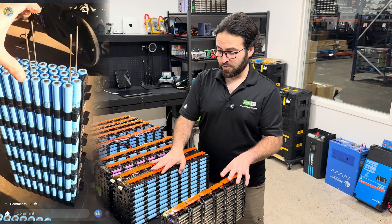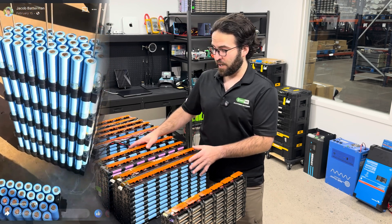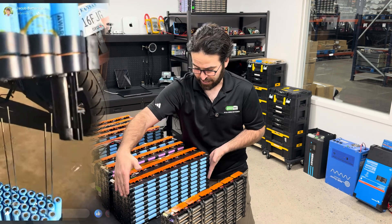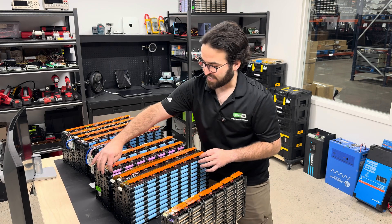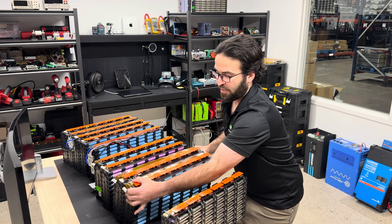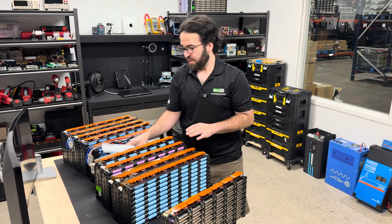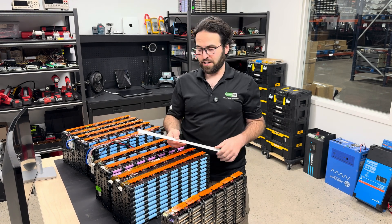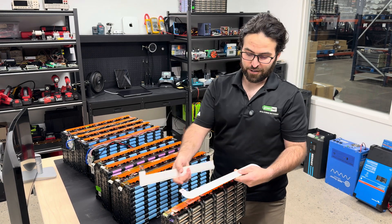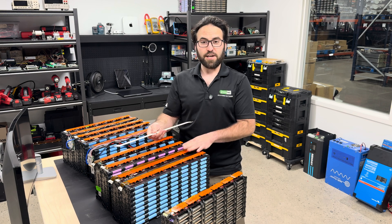Or these modules themselves — these battery cases — are an amazing solution for both mobile devices and home energy storage, because years from now when the cells wear out, you can take them apart. They have all-thread going through them connecting them together, and they even have a plastic tab system so that once you line up two modules, you just slide them together and they're locked like that — you can just keep adding more on the sides. If you wanted to connect them into series, Greentech sells bus bars. They're not listed on the site, but if you buy multiple modules, just reach out for pricing and availability. There's one for the 21700s, which is a little bit shorter because it's a 6s configuration, and then one for the 18650, which is a 7s configuration.